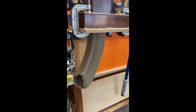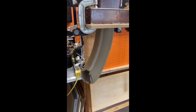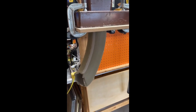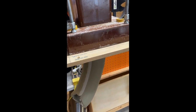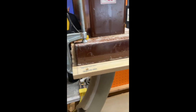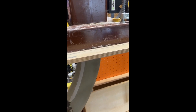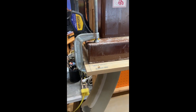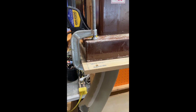So a little bit confounding, a little bit of embarrassment, but the other thing I wanted to point out is the pieces that I use for the filler frame, they're great. But as I had the die extremely moved to the front, and I was just using the quick grip clamps, the die plate pushed down and was pushing clay out, and it just plainly wasn't working the way I had it set up. So what I did, as you can see, for the second attempt here, was put the Bailey C-clamps in place to give me good support at the front.